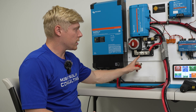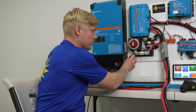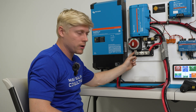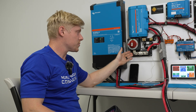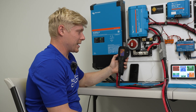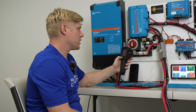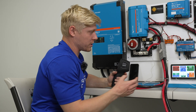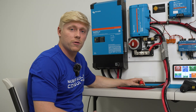We're going to start by running 100 amps through this Class T fuse. Because the switch will also get warm, when we swap fuses we're going to land the fuse holder in the same spot attached to the switch through a link bar — an LB2, a very heavy duty conductor — to keep these tests equal. This fuse holder is torqued to spec at 21.5 newton meters. This is a FLIR temperature camera, but I don't fully trust it — I'm pointing it right where the thermocouple is under the nut and getting 25.5°C while the thermocouple reads 33.6°C. I definitely trust the 33.6 more since the room is about 25°C.